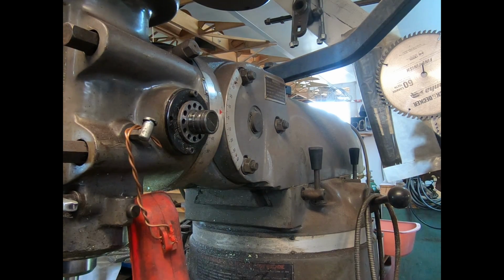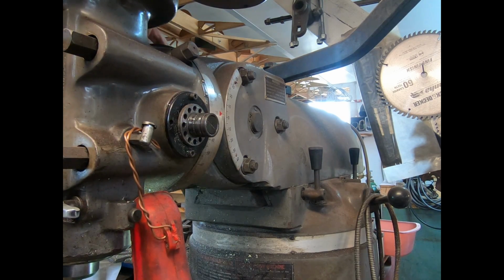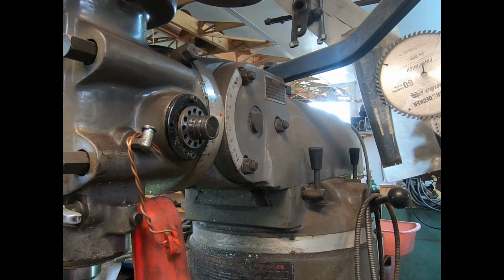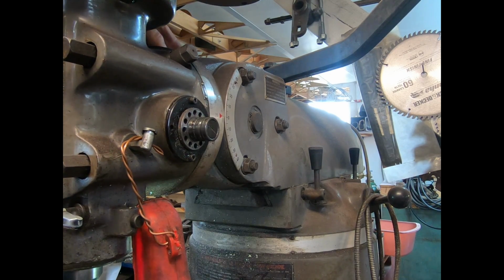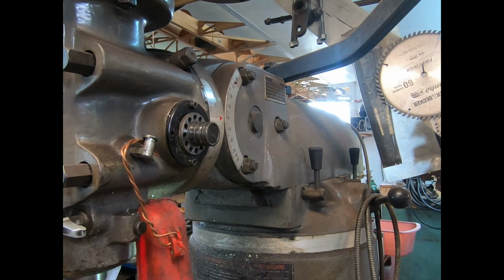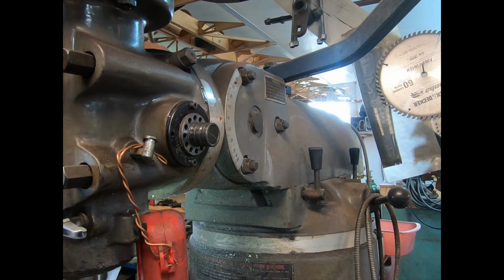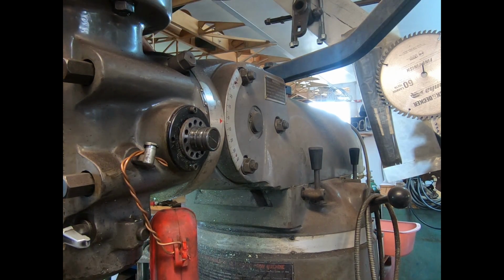And I'll see what we can do here. Of course, when I do this, I'm going to have to set my depth again too, because that's going to frig up my depth. Guess I better go down with the table and I'll figure that depth out in a minute. Well, that changes that a lot. Of course, the arm's out there a long way too, so guess it probably would. Okay. There's 3 degrees.